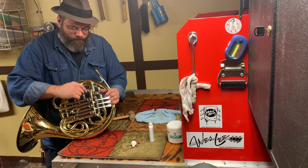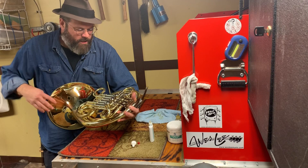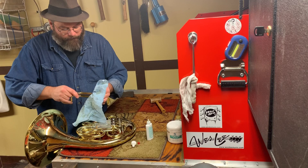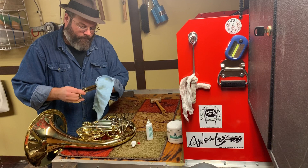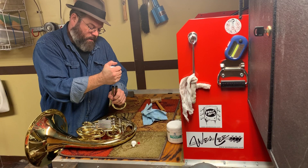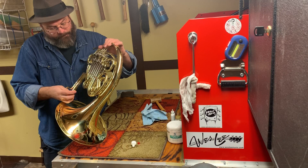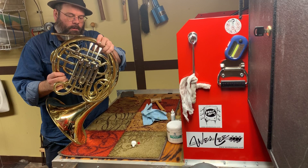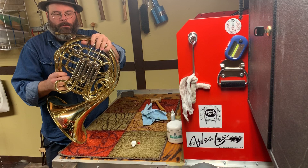Now I'm going to show you another way to oil the faces. We want oil to coat all of the surfaces. Another way to accomplish this is to clean off the crud that's built up right in here, put some oil down in the slide, hold it up, put it in, and then as I flip it over I want to blow it through to coat all of the sides of these rotors.